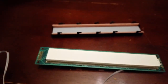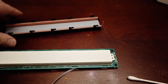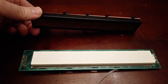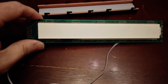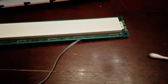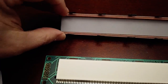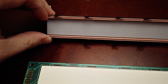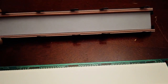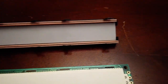This is part two of trying to get the display on my Oberheim OB-MX working again. A commenter on my previous video suggested I may not need to replace the display - that I can just clean the contacts on the PCB, clean the contacts on the zebra strips that connect the PCB to the LCD, and also clean the contacts on the LCD itself.